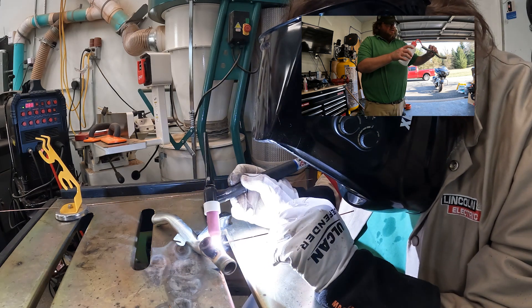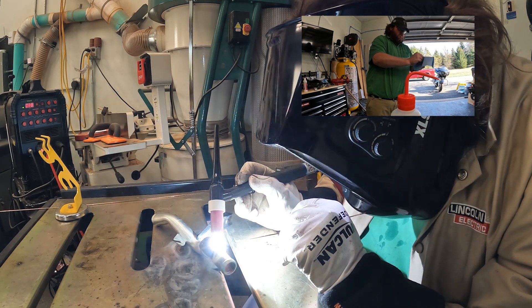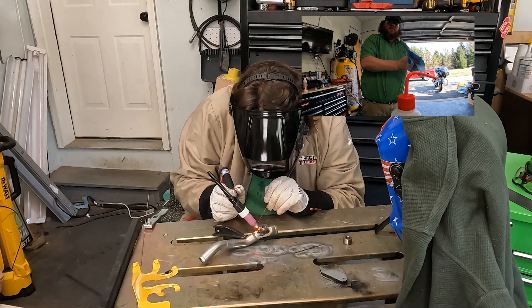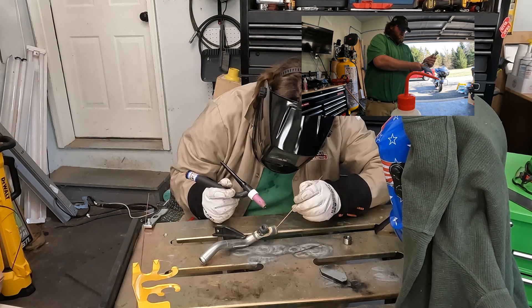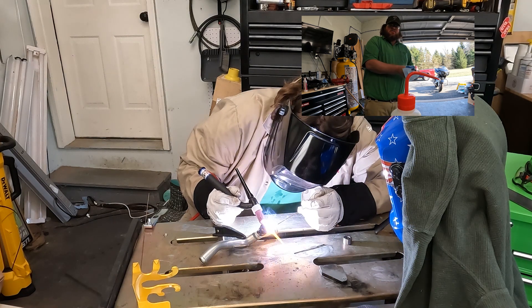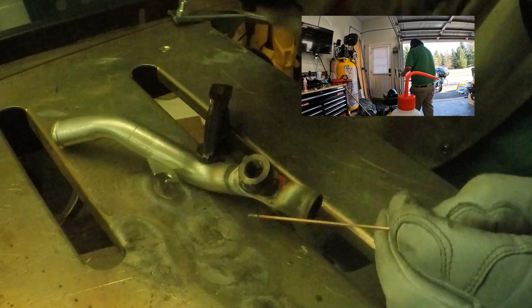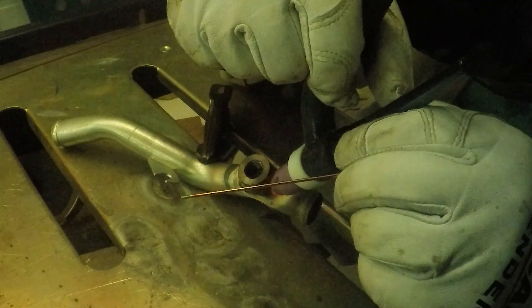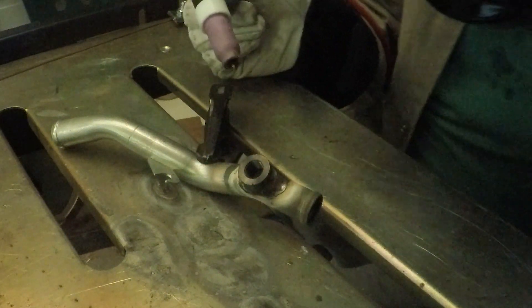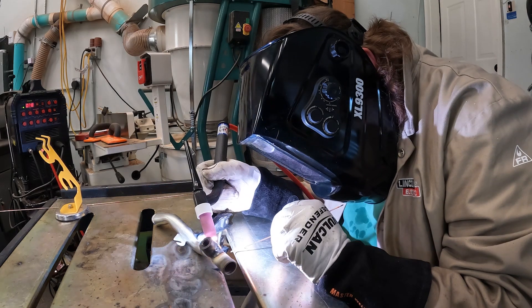While we're here, just going to cover a quick safety tip. After cutting and drilling the hole and before welding, I used a little bit of acetone and blew out the piece to make sure there weren't any chemicals remaining from the cutting fluid on the metal itself. One thing to be really aware of is brake cleaner — that is a terrible chemical to use when you're going to be welding, because when mixed with superheated argon it actually creates a terrible gas that will kill you. If you are ever welding and you're not sure the material is clean from any chemicals, definitely take some time to clean it off before you hit it with a very, very hot torch.